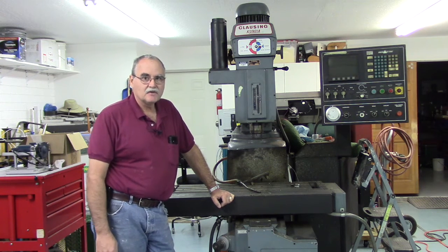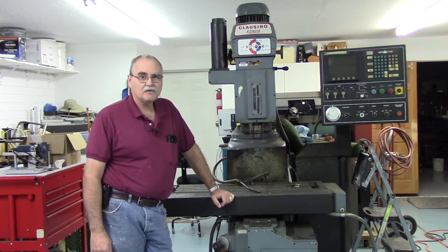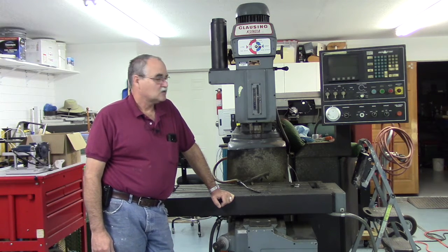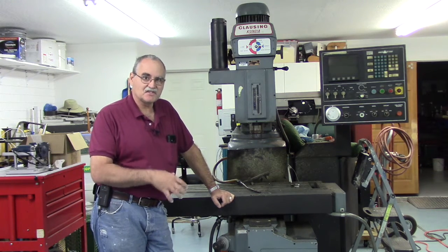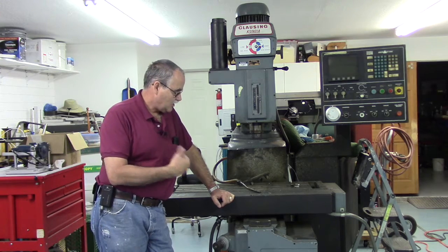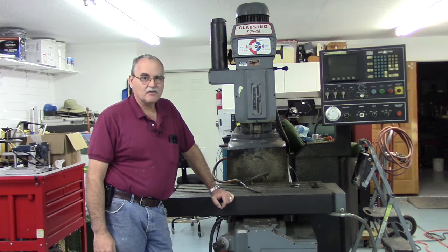It's an example of a typical knee mill that's a dedicated CNC. There are hundreds, if not thousands of them out there. I'm in the Phoenix area and I've come across a couple of these mills that were ripe for retrofitting, so it's not impossible to find a machine. The nice thing about finding a machine that was already designed as a CNC mill is that it already has ball screws, it already has limit switches, and it's dedicated — so there's no conversion needed and you don't have to change screws out.